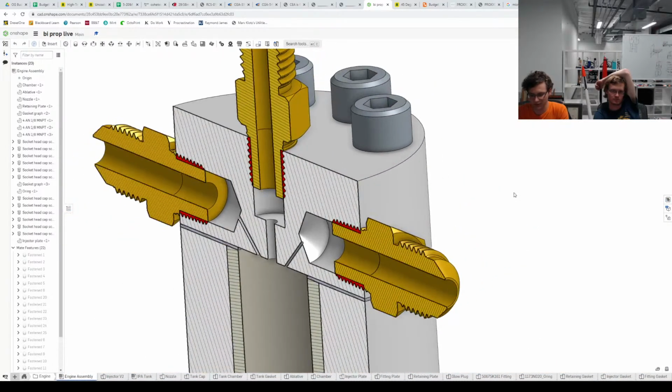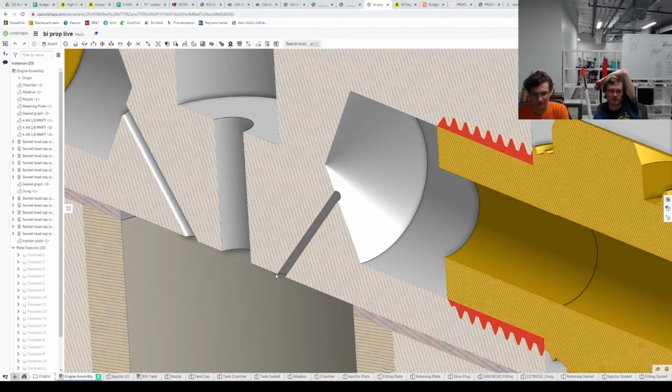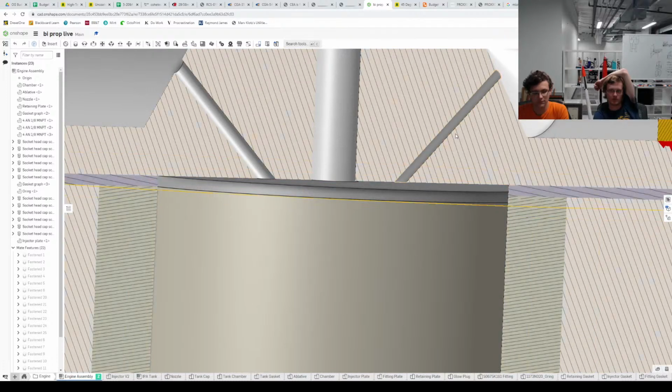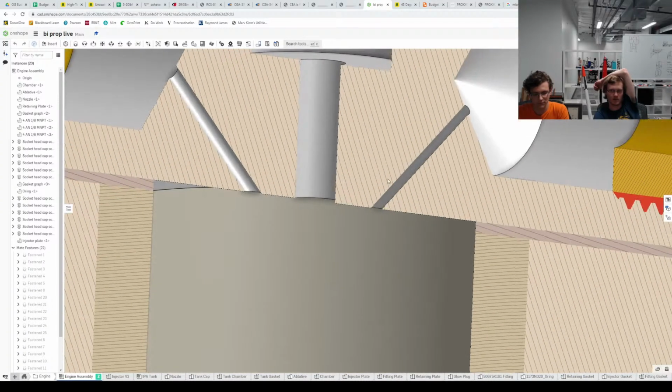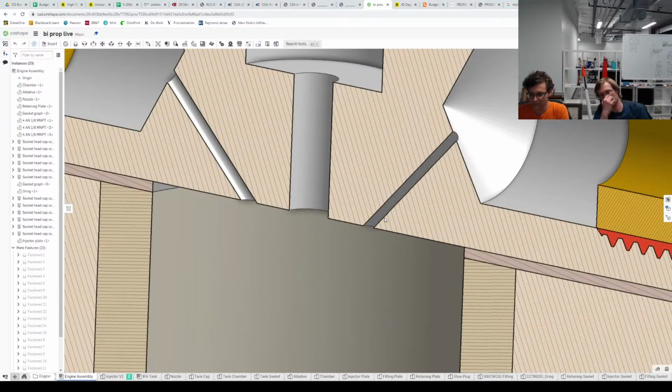There won't be any divots because it goes all the way through, right? No, but it's drilling of that hole. The bit's gonna wander as I'm trying to drill this 45 degree, so I have to make an end mill spot face here that's perpendicular to the drill. So there's gonna be a little tiny cutout right here that's the circle. But now I have all of this material to drill through. That was the problem, because I didn't want to do that with these little drill bits. No, it's not that much. You say that, but it's a lot. You don't want to drill 6.6 millimeters?